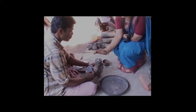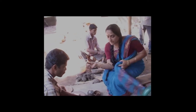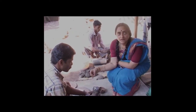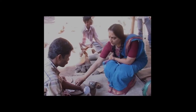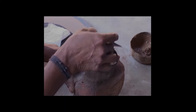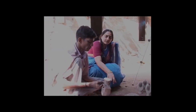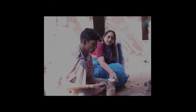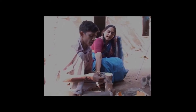This is the 33% delta bronze alloy to be cast in that thin blank as mentioned, which will be polished and is fully breakable. He seals the mouth of this crucible with first paper and then cloth. This is the cup of the crucible in which the metal to be cast is placed — it has now been covered with newspaper and cloth and sealed with clay.